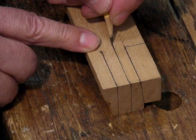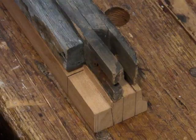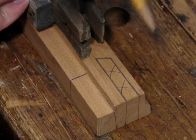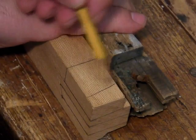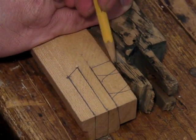And then marking it here. There's also the angled bottom of that mortise. The last step of layout is to mark out which parts of the joint I'll be cutting away so I don't cut off the wrong part. I lay the old joint right next to it and mark all the parts of the joint that I'll be cutting away.